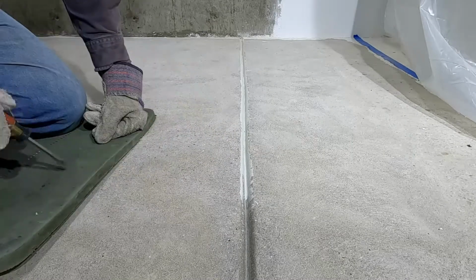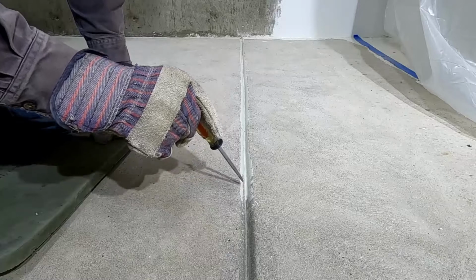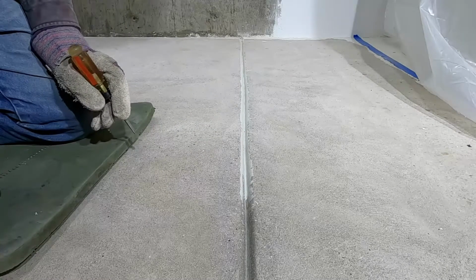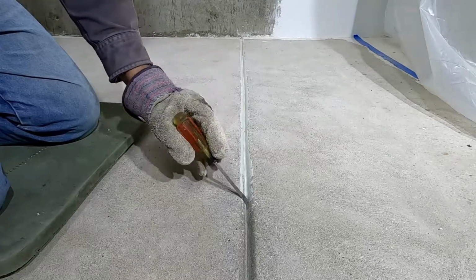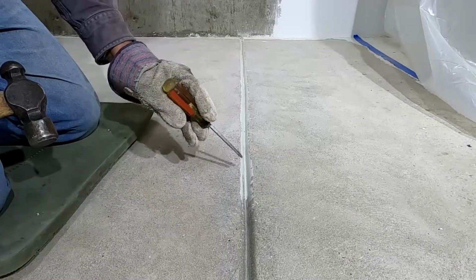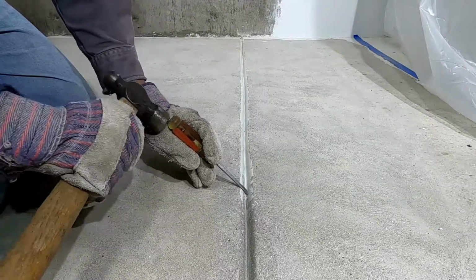And then I switched my technique up a little bit more to try to get the epoxy out of the bottom of the control joints first, and then using an abrasive wheel to get the epoxy out of the upper part of the joint. So what I ultimately discovered is that actually just an ordinary 3/16 inch screwdriver, one that was well worn, so it's now sacrificial, I just come along and start a little higher and find that the epoxy is actually a little bit brittle.